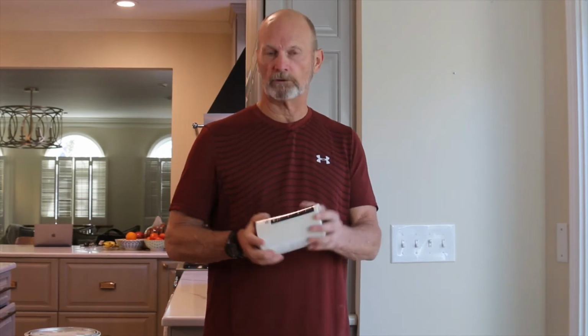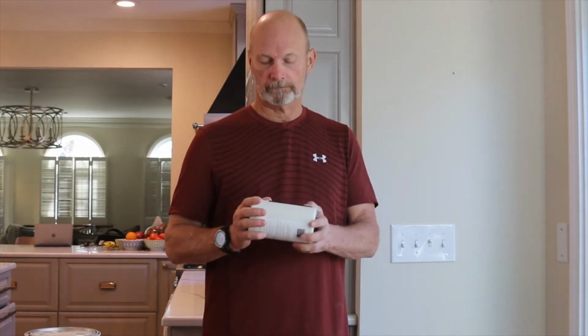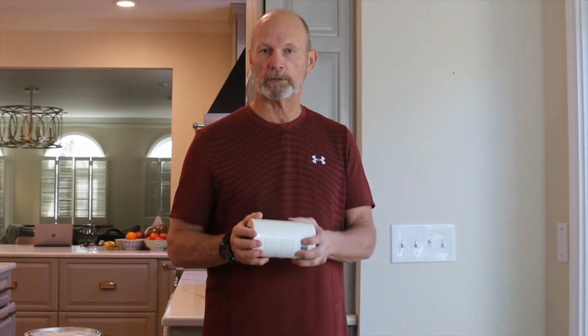This is, if you have a big gap, a fabric that's adhesive, and you cut off the piece that fits the gap, lay it over it, and then start putting mud on it, and then lightly sand it. So that's all the tools. Don't really need anything else to get this job done. It's really inexpensive and fast.